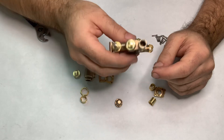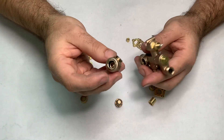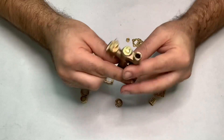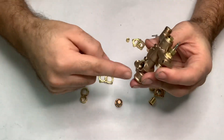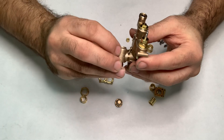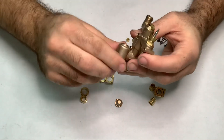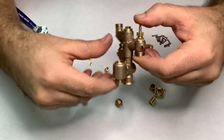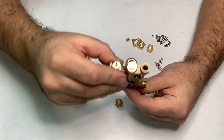We're going to set this up for left hand. Typical practice was to have the overflow body facing outward of the locomotive to make it a little easier to see from the cab. So if this injector was sitting on the left hand side of the engine, the water valve faces back and the delivery comes out towards the front. This is clocked in so once you get good tightening on it, it sits straight up and down.